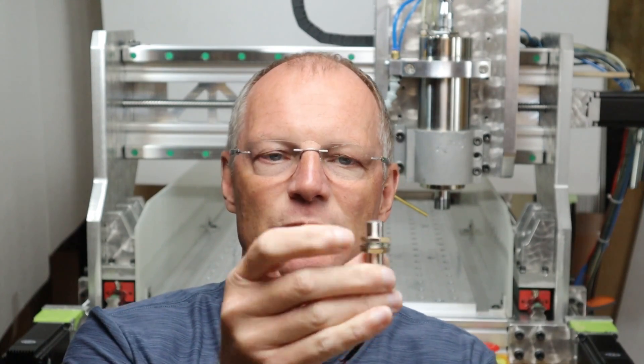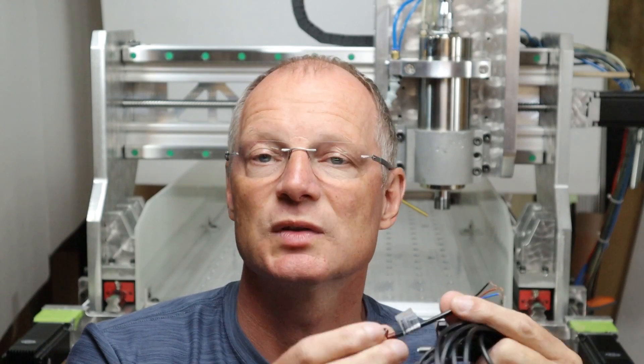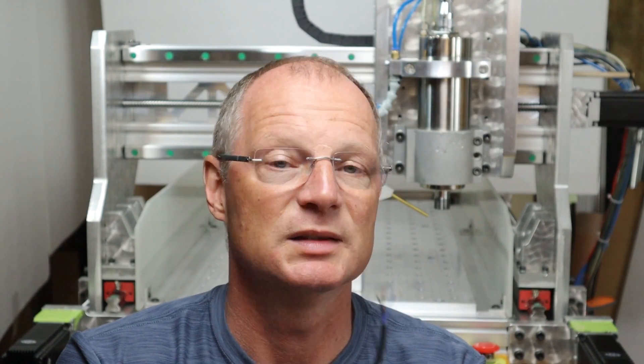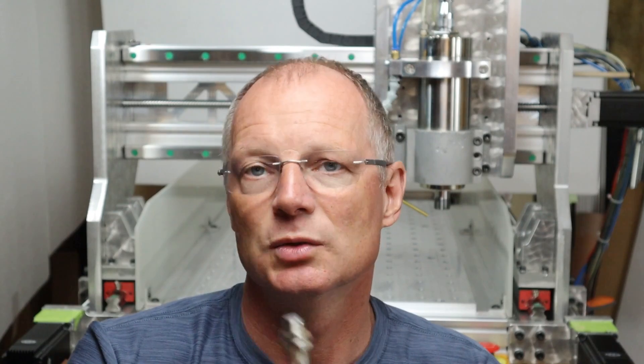The next one is a hall sensor — basically a magnetic switch — so it needs a counterpart where it will sense the magnet arriving and then it switches. The nice thing about these is they are also relatively cost effective. This one has an LED on the back and a three-wire hookup, so you need to order it in the correct version: normally closed, and either NPN or PNP.